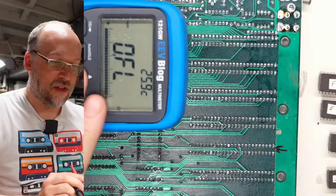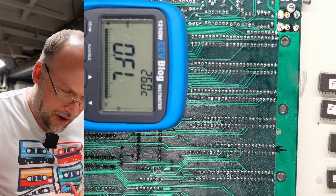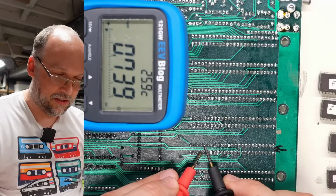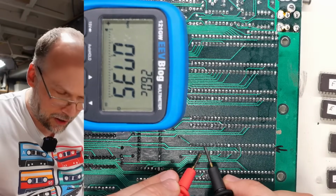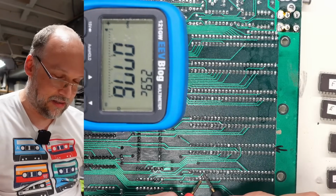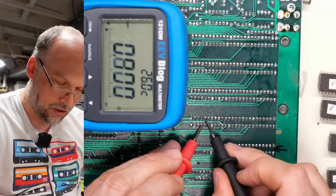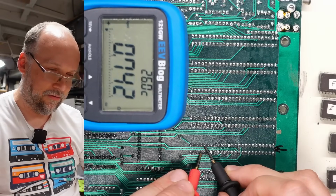And with a little bit of multimeter sleuthing, and I've turned off the beeper because I think that annoys a lot of people, I think I figured out that it's this slot right here where the short is happening. And the reason why I say that is because the resistance, which you can see there is 0.74 ohms or so, is the lowest on that slot. And here I moved over to the next slot. See, it's close, but it's higher. It's 0.77. And on this slot right here above, 0.80. Let's go back to the one I think is the one. Yeah, 0.75.